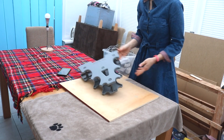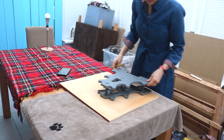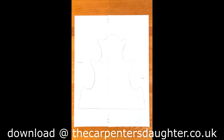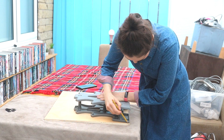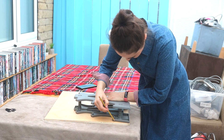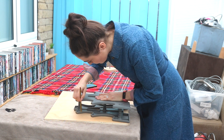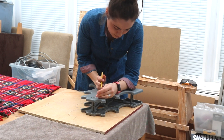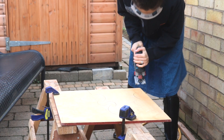First things first, if you don't have a flimsy dumbbell tree to draw around, don't worry — I've drawn around it for you on paper, which you can download for free as PDF plans from my blog post link below. So assuming you've done that and cut it out, I then found a 12 millimeter thick offcut of plywood big enough for me to draw around the dumbbell rack twice. And there's various ways you could cut this.